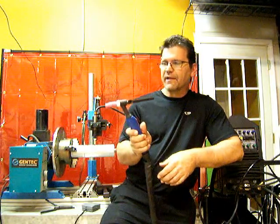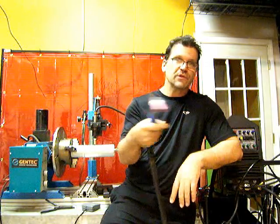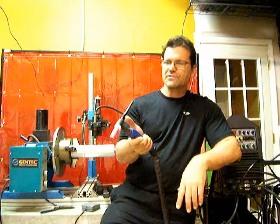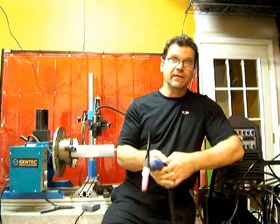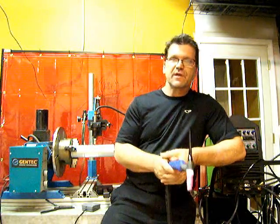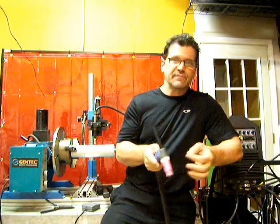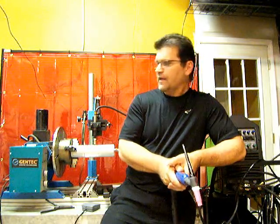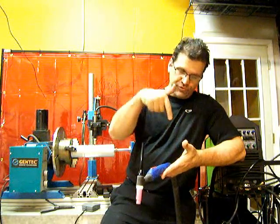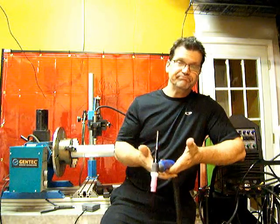What I've got here is a stationary torch hooked up to this welding machine, but I've still got to control the switch for the torch hooked in the remote slot. I'm using this button with the 4T position as an automated switch. It looks funny that I've got a torch in my hand but I'm running that torch remotely. What we want to do here is check TIG welding parameters without the influence of the operator, because when you set pulse settings, one guy will make adjustments without even knowing it. Sound fair?